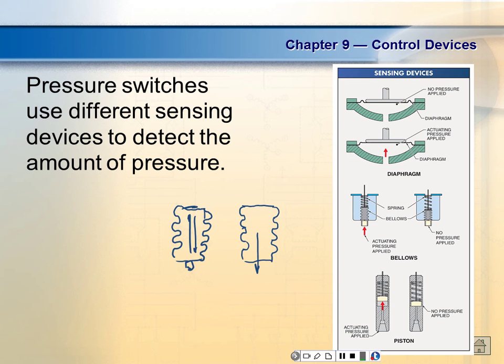The piston type works differently — it has a calibrated spring and we put pressure into it. The force generated against the piston uses the formula: Force equals Pressure times Area. So if the piston is two square inches, we take the pressure times two to get the force. We're pushing against the calibrated spring again, and this force depends on what pressure is applied.